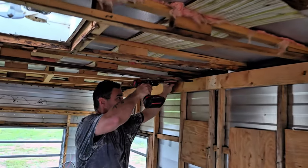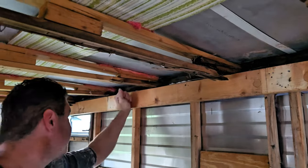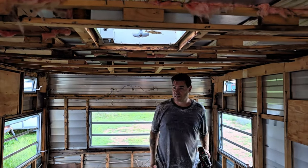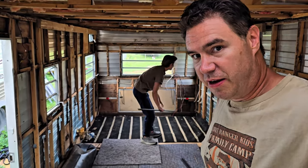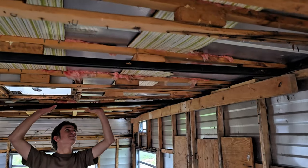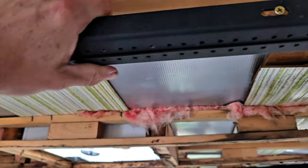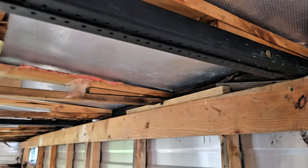We're putting up a board to support the roof here. We've lifted that quite a bit and we've got to do another on this side still. Then we've got to brace our cross beams — we got some metal that we're going to put on some of them and hopefully that'll do the trick. What we're doing is putting some metal up on these beams to give them some strength, because they're not so strong at the edges since they're rotting away. We're adding steel that reaches over onto a two-by-four we put down the edge.